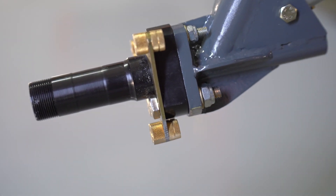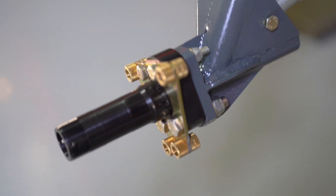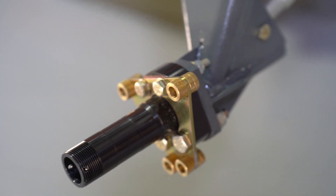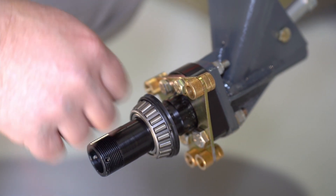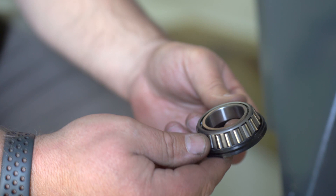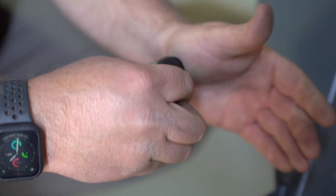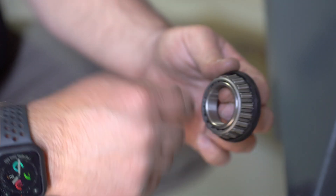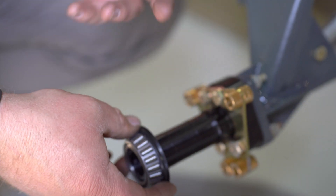This configuration is for the 27.5 inch tires from Aero Classic. I would recommend that the brake plate — the one where the calipers will slide in and out of — be drilled by an engineering place. As you can see, these bearings are not greased, so just make sure to pack them nicely with grease. There is a specific method — search on YouTube for tutorials on how to pack a bearing. Basically you're going to have some grease on a sheet and squeeze it in, then turn it to make sure the grease is going through all the bearings. Don't put excessive grease — this is not a trailer where the wheels are turning all the time, so excessive grease is just a collector of dust.